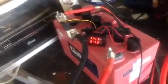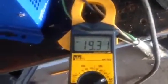There we go — the battery charge is pretty well staying the same, between 50 and 60 there. Now we're drawing 19 amps at 120 volts, so roughly 20 times 2 is like 2400 watts — 1000 there and 1400 or so over there, plus whatever is being lost. Now I'm going to put the microwave on and see what blows up first.